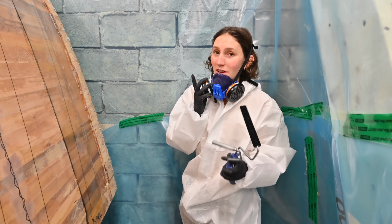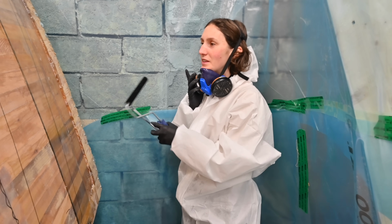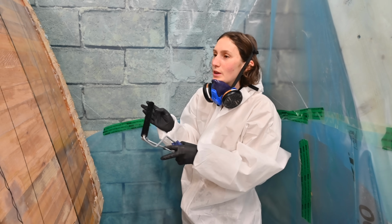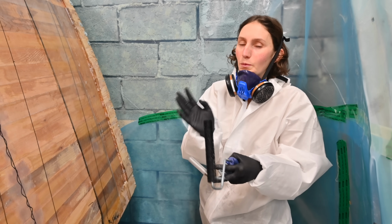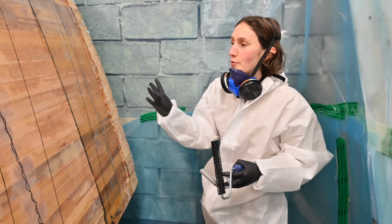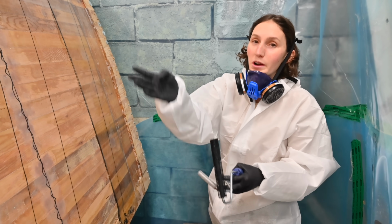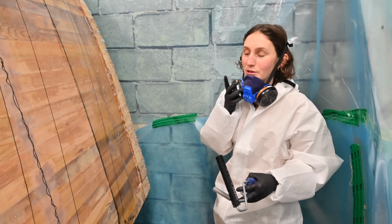Officially started on the other side of the hull. The first piece is applied, and this is the most narrow one that we will place on the whole hull, I guess. And this is to start the sequence of overlapping with the different pieces of fiberglass. So we're going to have three narrow pieces here. The next one will be a bit wider, and then the third one a bit wider, and then we're back to the full width of fiberglass length.